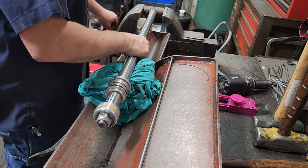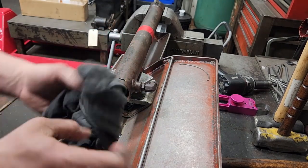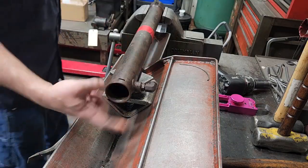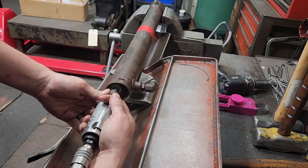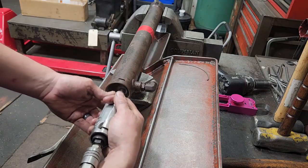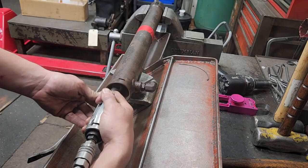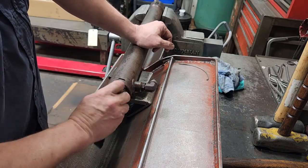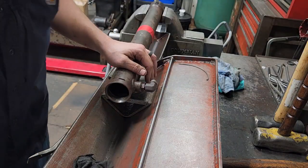Once that's tightened, we'll remove the rod and put the tube back in. The end of this does have some that needs some cleanup. I'll take a cleaner rag, put it in the tube, then I'll get a wire wheel on my die grinder and clean that up. Once that's all clean, grab your rag — do not forget it — and clean up where we just cleaned, inside that groove. Still discolored but it's smooth, and that's as good as we're going to get that.